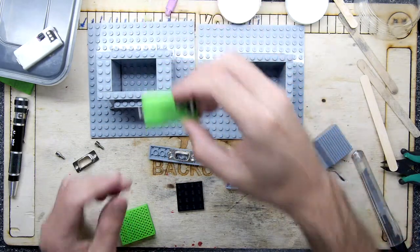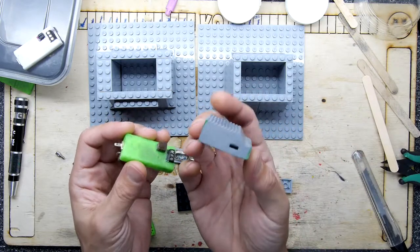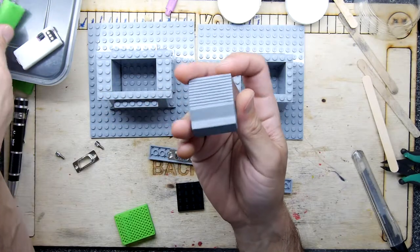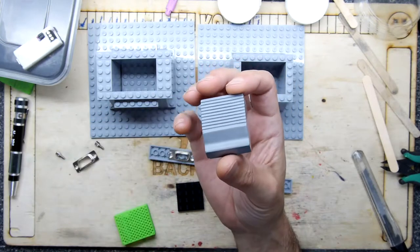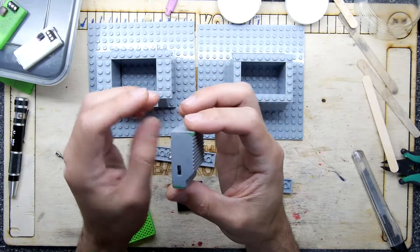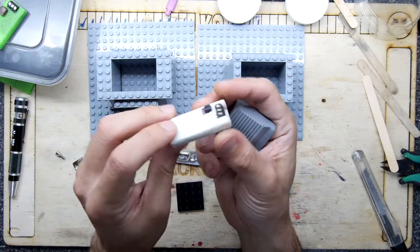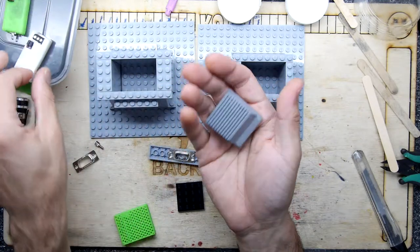And the idea is you build something like that, which is technically what this is, but it's been primed and sanded because I wanted a bit of a better finish, as much of a finish as you can get on it for a 3D print. So you can see it doesn't quite look 3D printed. But the problem is, if you make a cast off this, and I've done that in the previous video you might have seen, it ends up looking 3D printed. So really you have to put some high build on there and hand work that till you can get something as smooth as possible. Because if you don't, you end up with something like this, which was this one, but sanded down by hand, and it's a lot of effort, and it's not a great finish to start with.